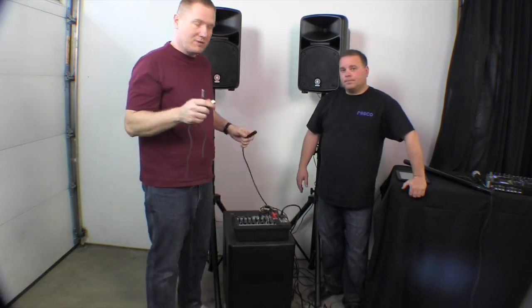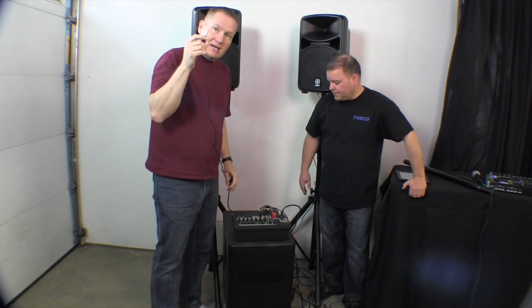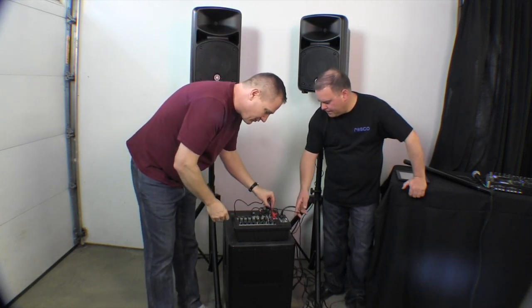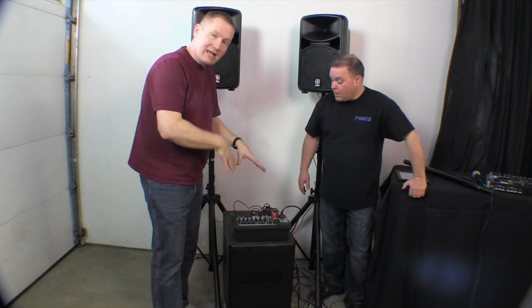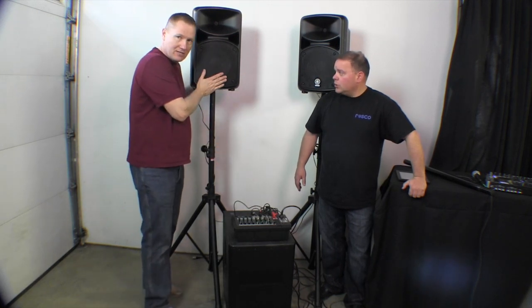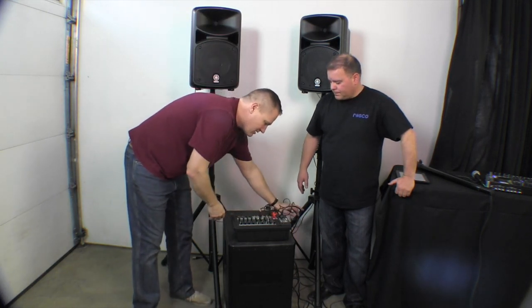On most speakers that will work. In a bind, ideally we'd have the wire a little different, but it needs the tip sleeve. Once you plug it into the subwoofer out — and this is somewhat common now in the industry with speakers that have a quarter-inch subwoofer out — once you plug in, it activates a crossover and rolls off the frequencies going to the top speakers. So now we're not having all the sub-signal going to the tops, and it's sending that to the subwoofer.